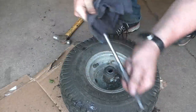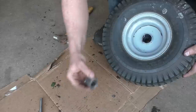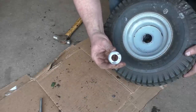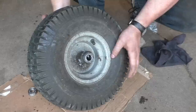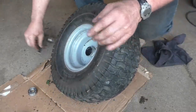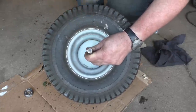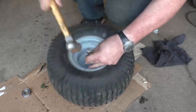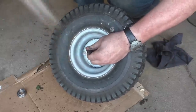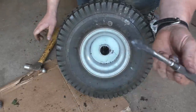It's a bit messy — if people actually maintain their machine there'll be lots of grease in there. This bushing did not need to be replaced; I'm doing this video for educational purposes. Since this bushing is further out on the rim, I hold the tire and knock it out like that. There we go — look at all that grease.